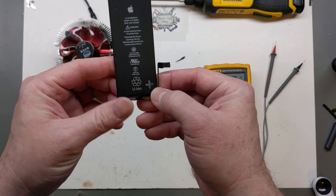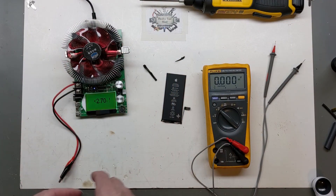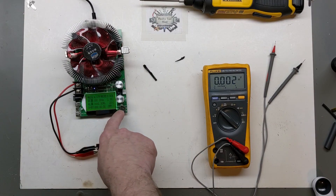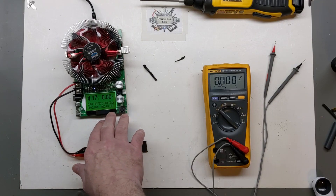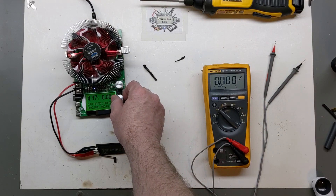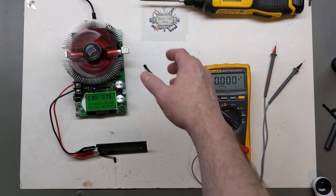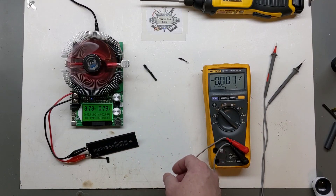So, 4.2 volts. I'm going to bring over this capacity tester. I have it set for 2.7 volts where it'll cut out, and this will tell us our capacity. If I hook up our minus and our plus, the alarm should go off — and it does. We toggle it twice and we see our 4.17 volts in, with no data collection yet for time or amp hours. As soon as we get above about half an amp, the test will start. I'm going to go to about 0.7 amps just to make sure the test doesn't stop if it drops down. This video is straightforward — I'm just going to let this run and come back to see where it alarms, and how close we are to the 7.45 watt-hour rating of the pack's specs.